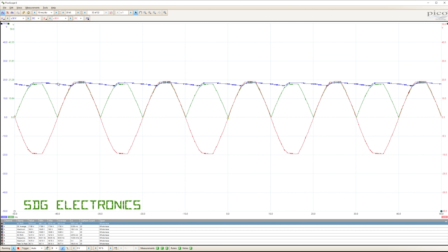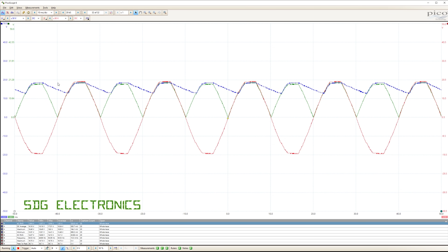As we increase the load on the hybrid bridge rectifier, it looks very similar in behavior to the standard bridge rectifier — it follows the AC waveform nicely with no weird discontinuities, which is what we were seeing on the fully active synchronous bridge rectifier from LT. Let's take a look at that one next.